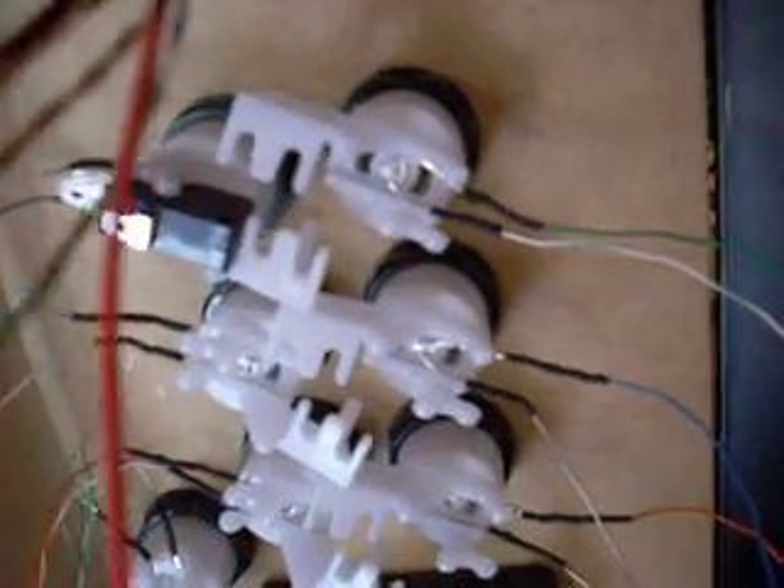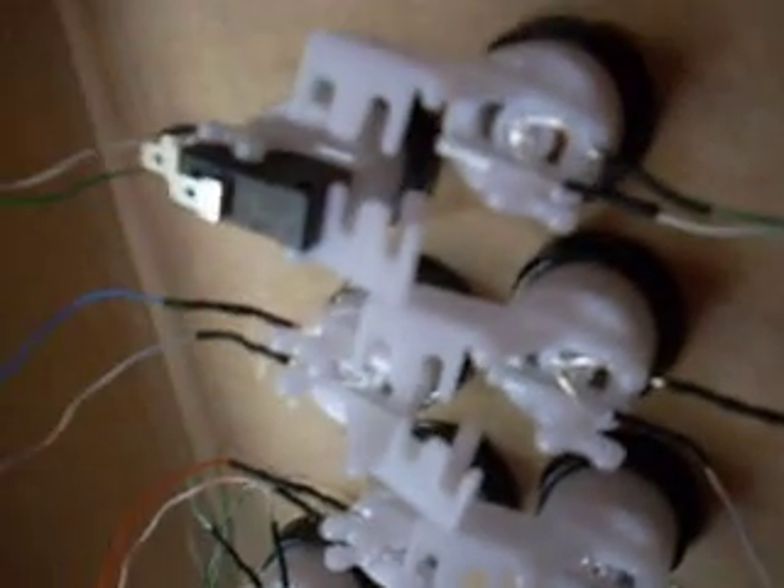As I demonstrated before in the installation of the LED wiring and the actual wiring of the LEDs in my other videos, we're going to put in the switch here. This is the actual micro switch that does all the work when you push on a button. A little arm comes down from the button and hits the contact right there. You've got to make sure that all of the wiring, the heat shrink, and the shielding is away from this little tiny piece of plastic arm that comes up and actually pushes this button, because if you can't push the button, then the LEDs don't mean anything.